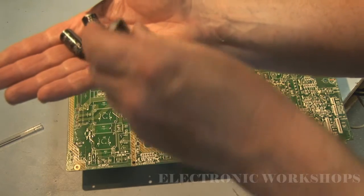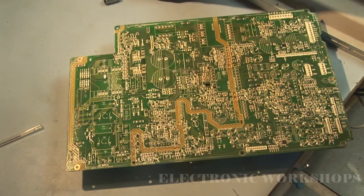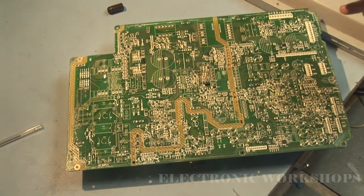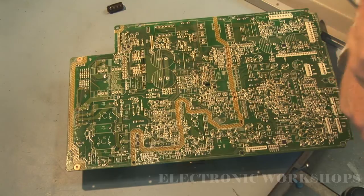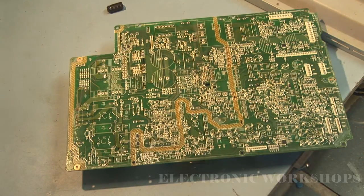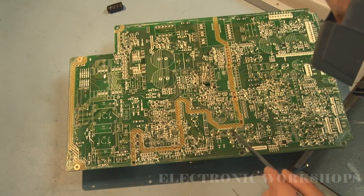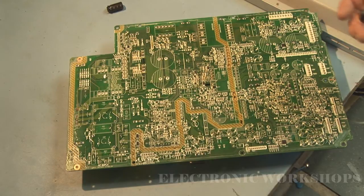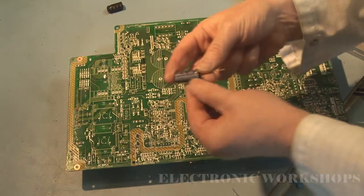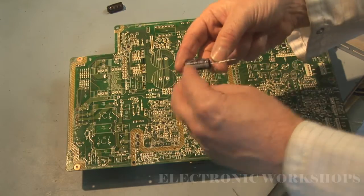That's my four capacitors — the two 680µF and the two 3300µF capacitors. I'm going to get some from stock and stick them in. There's one thing you have to bear in mind when doing these capacitors: they are polarity conscious. If you look on the board, there are stripe markings — that's where the negative lead of the capacitor is oriented towards. The negative lead has the negative symbol on that side.